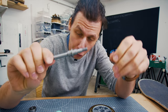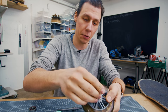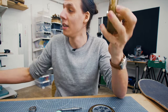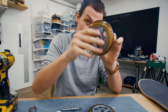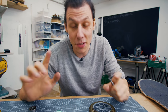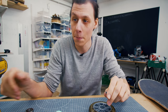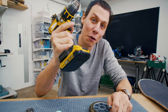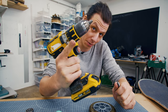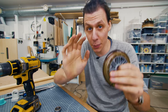We've got our shaft, but before we go any further let's quickly have a look at what this thing actually needs to do. Normally on a regular scooter wheel you can put a shaft through the bearings and it will spin, which is great. But we want to be able to drive this thing with a drill, so we need the shaft in the middle to be connected to the wheel so that when we drive it the front wheel also spins. But that leaves us with one challenge — on a regular electric scooter when you let go of the gas it will still roll, but this thing, when you let go of the gas, it just stops, which would lock up the front wheel. So I need a way to have this shaft connect to the front wheel but still spin freely when you let go of the gas on the drill.